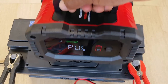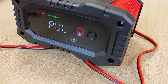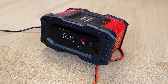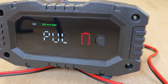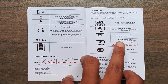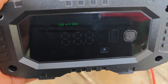Note that it's recommended you don't keep the charger on top of the battery while it's charging — I've just done this for filming purposes as the screen of the charger gave me the least reflection and glare in this position. The repair function pulses high voltage through the battery in a bid to break down those hard sulfation crystals which have deposited on the battery plates in the cells. The good thing is that repair mode also charges the battery, so this is like killing two birds with one stone, even though it takes 16 hours on this tool as against the few hours it would have taken using the 20 amp charging mode.